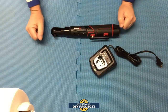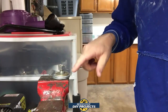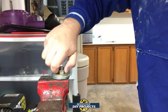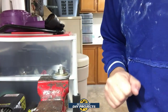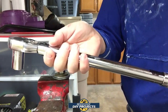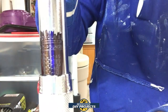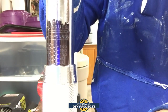Now let's move on to torque testing. I have a big lag bolt in the vise tightened up so it won't move, with a couple of washers and a nut that I'm going to tighten up. I'm going to torque it to 60 foot pounds — which is what the ratchet claims it can do. I have my torque wrench here set to 60 foot pounds. Let's tighten it up and see what it can do, then try to remove it.